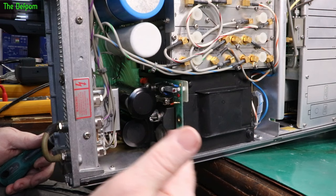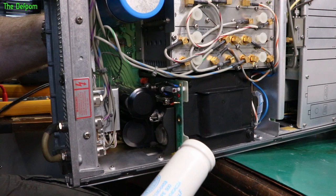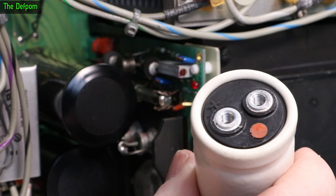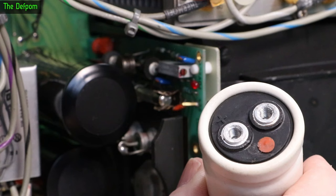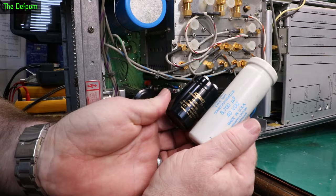Next one — positive is on the left-hand side. No signs of leaking. That's a 4200μF cap so I'm substituting with the 100V 4,700μF — slightly beefier, but that's not a bad thing. Positive to the back. Next cap: this one is 8700μF 40V, and there is actually a tiny bit of staining just next to the vent — I think it's starting to leak. That's exactly why I wanted to replace them. I've replaced it with a 10,000μF — significant difference in size.